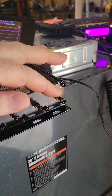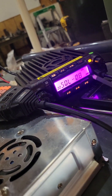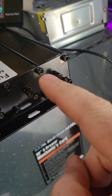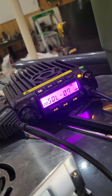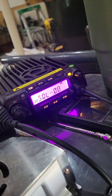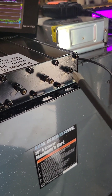I'm going to start tuning these screws and see if we can get it down a little bit. I'm going to go to eight — okay, got a solid busy indicator. I'm going to tune this just ever so slightly. We lost it at eight, and I tuned this one in just a little bit. Going to seven and we got it again. This is a very slow iterative process. I'm still good at eight, so going to seven — adjusting this screw. Every time I get it to go down to a lower squelch level I'm going to switch to another tuning rod and keep going back and forth.